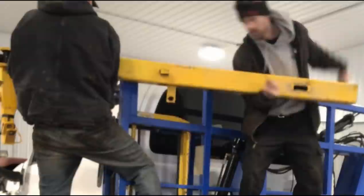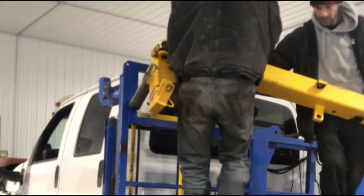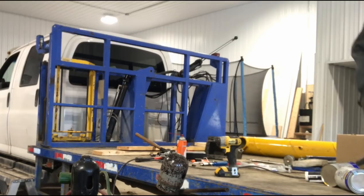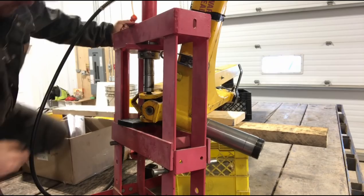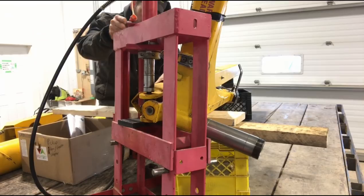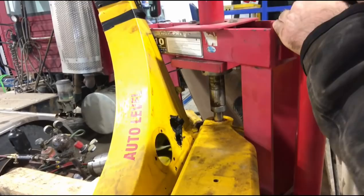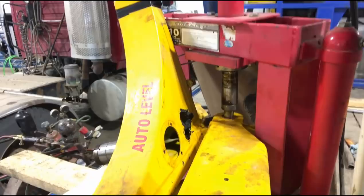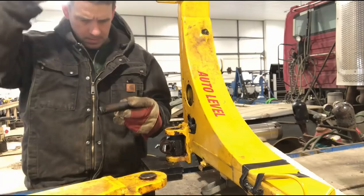It's worth our lives doing this — I'm standing with one foot on a step ladder and the other on the deck, trying to keep balance with a hundred pounds or more cradled in my arms. One slip and I'm on the ground with this thing on top of me. Such a farmer. But we got it on the deck and got the press into place. I put a nut on top of the pin and a couple tons of pressure, and you can hear it — sounds like a gunshot. We had probably two and a half tons of pressure down on that pin and it just goes pow, pow, pow as it moves down. Tight, tight, tight — but we pushed it out. The other side we could swing a hammer, and that pin came out too.